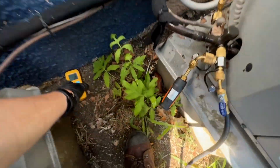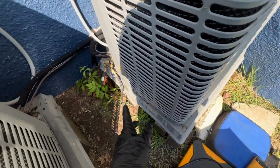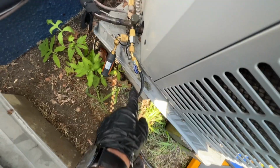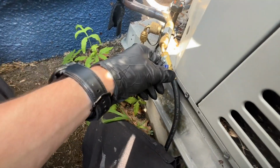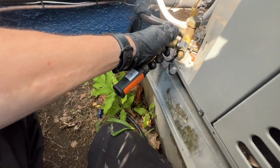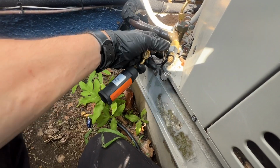Okay, so I ended that off at about 1.5 pounds. Bumped it up a tiny bit. I just wanted to show you how I disconnect. I closed my tank, opened up my valve to let all the liquid refrigerant out to minimize the loss. So whatever's in here will be vapor now. Take this off and take off our probe.